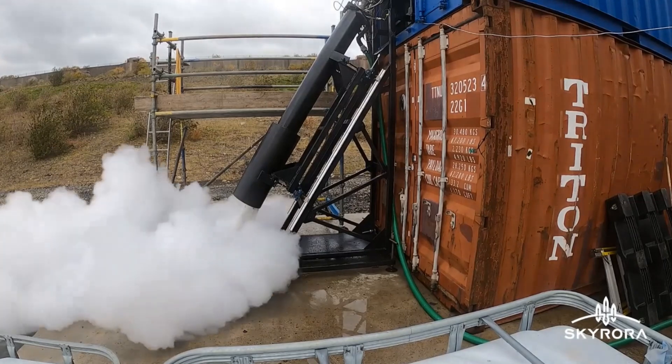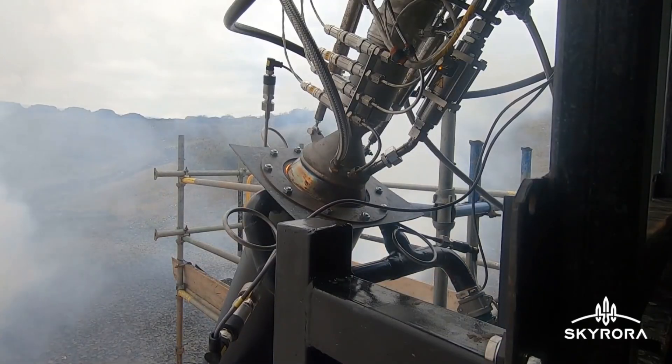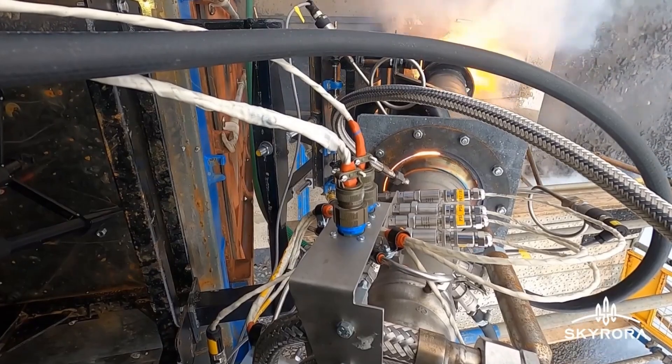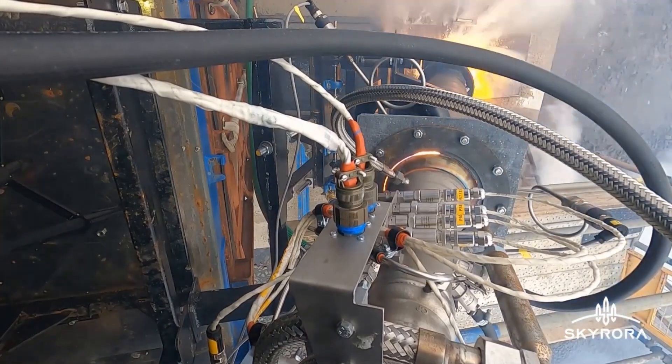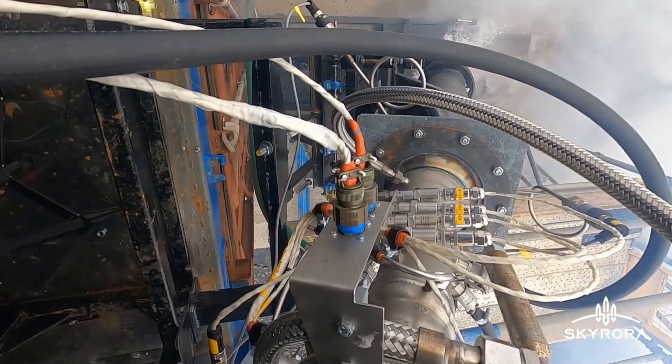Sometimes you'll find a system with fast-closing shutters that, as soon as they detect airflow backwards up the tunnel, actuate shut very quickly to provide a closed tunnel. Another thing about the diffuser — this enclosed tunnel section — is that it deals with a lot of thermal flux from the engines. So you want to keep it cool. It's quite common to find these with a water jacket around them so the tunnel doesn't get too hot.